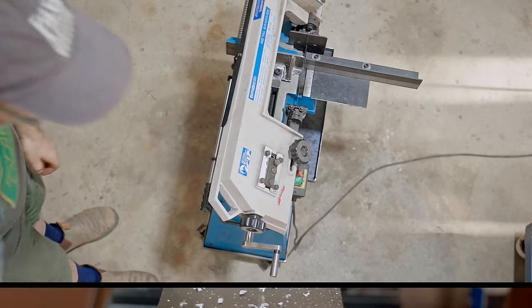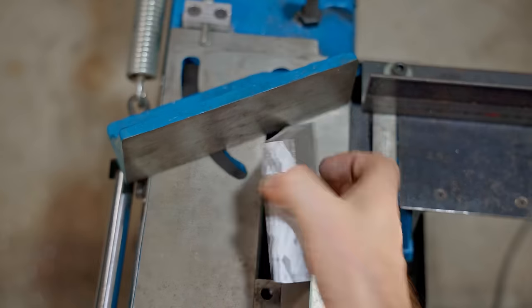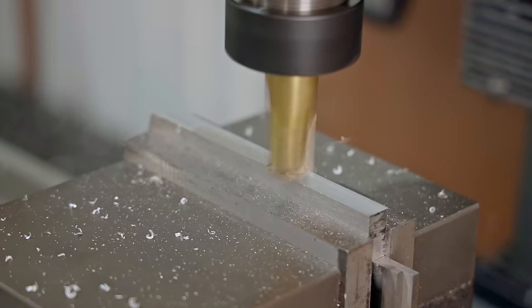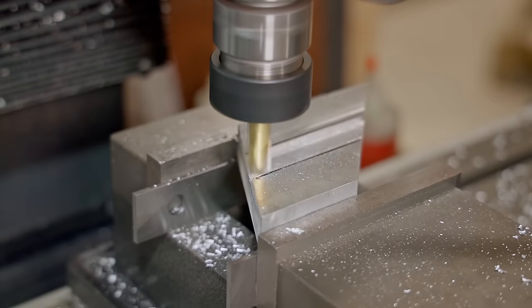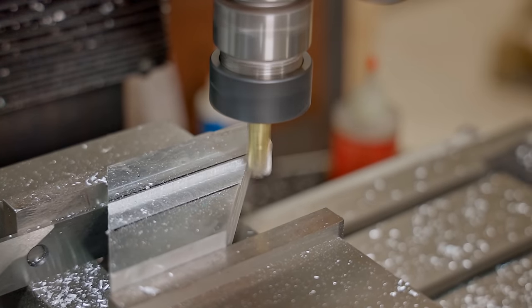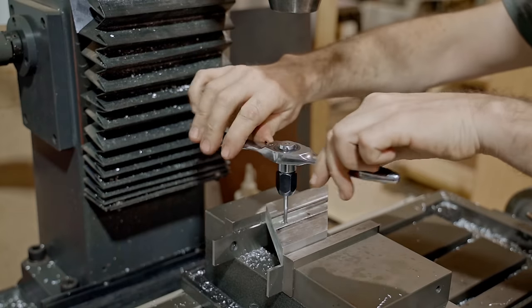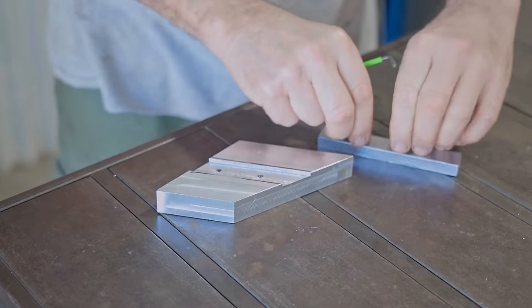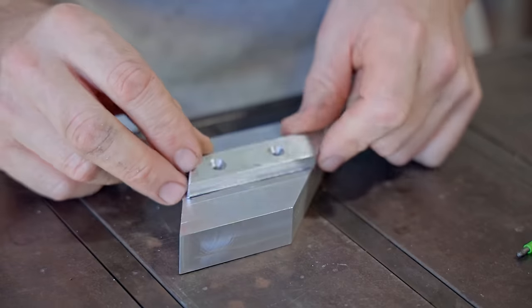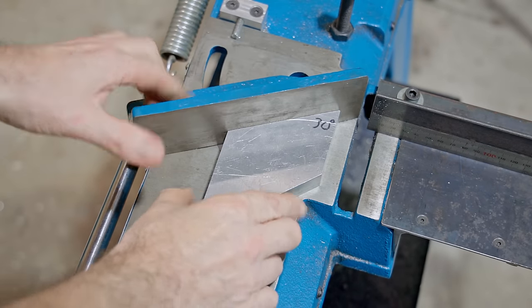For setting accurate angles quickly and easily, I'll make a quick guide block from this aluminium. These two angles are what I'd use the most. I'll mill out a slot for a key to fit into, which I'll make first. If I find I regularly need other angles, I'll make blocks for them then. But as I don't make angle cuts very often, I think this will cover things, especially the 45 degree one. It's perfect and it will be accurate every time.